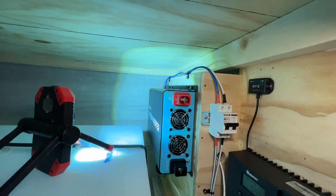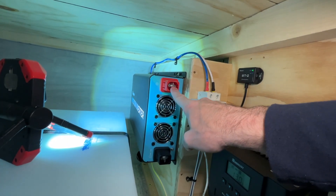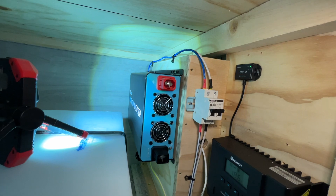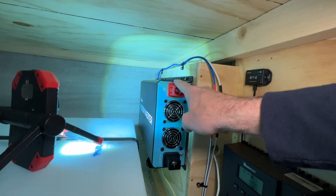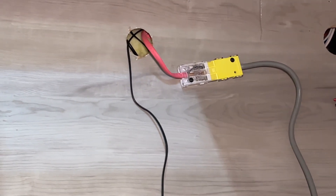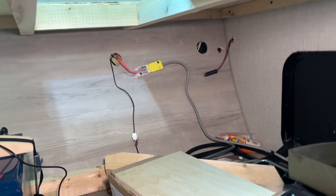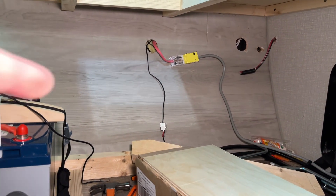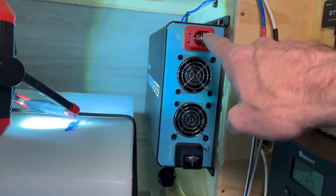Here's what it looks like installed — the screws are in the keyhole slots. To wire it up, I'll run the positive to the other side, the ground through the hole here, and hook them up to my positive and negative terminal buses. On the AC side this came pre-wired for an inverter — there's Romex coming out of the camper going into a box, then to a regular 120 volt appliance cord. It might reach, or I can splice into the Romex and hardwire it into the inverter.